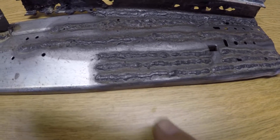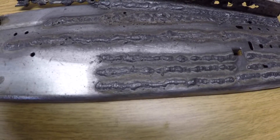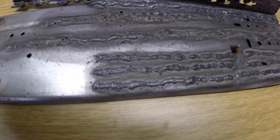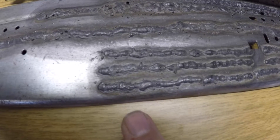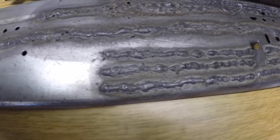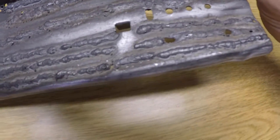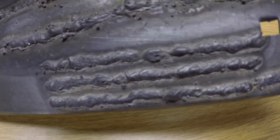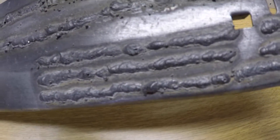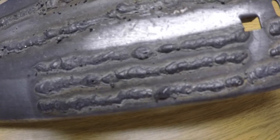These three rows are welds that I made on material that's only about 0.035 thickness. After looking at this after the fact, it looks like I went way too fast. But I wasn't welding anything together — I was just running a bead down here, trying to make as straight a line as I could, to see what kind of bead I could make. This is so I can compare these welds to the welds I produce after the modifications — comparing my skill level with the machine before versus after.